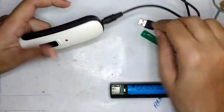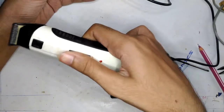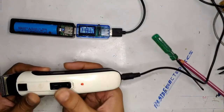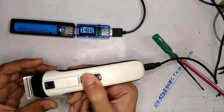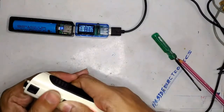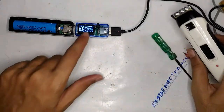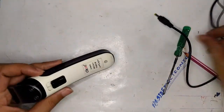The reason I'm tearing this one down is not just for this video — the switch has also been damaged and is no longer making good contact, so I want to replace it. You can see it reads 5 volts at 0 amps. When I press on the switch, it runs — so the switch has a contact issue. Now it's spinning and you can see the power consumption is around 500 milliamps, going up to about 2-something watts. That's the power consumption of this trimmer.